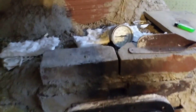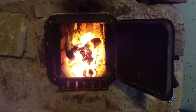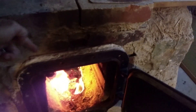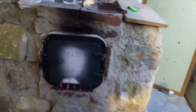The best thing I like about this is with that bypass open, I can open the door and not get smoke back into the cellar. I've got good draft — none of the smoke has a chance to come down here with the door open and bypass open. If I close the bypass, obviously there'll be less draft and I can get a little smoke back into the shop. You might notice my door — this is just a barrel stove door, non-airtight, but I made it airtight. I wrapped one inch of ceramic blanket around it, then added rope from an old oven, and that seals it up real nice. So now we've got an airtight door for when I close the bypass and reduce draft.